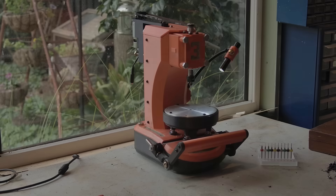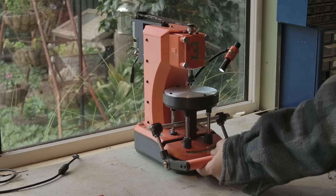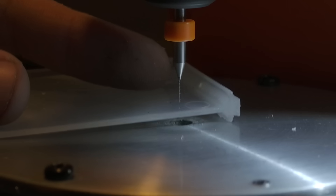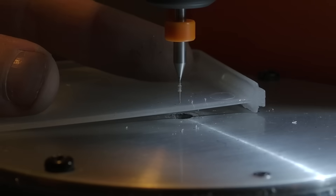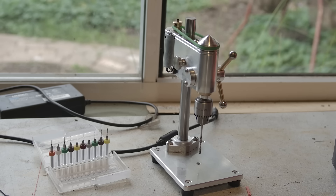I'm going to call this operator error, and the fact that the machine should be closer to 30,000 RPM instead of 24. All things considered, I think this is a great result. I'm not bothering with properly setting up the motor, since I'll be setting it up with a larger motor at lower speeds when the parts arrive. I can't imagine I'll need a 0.3mm hole any time soon. I'll flash a rough cost breakdown on screen now. As you can see, it's not very much for what it is — it's about half of what this cost me, for dare I say a much better machine.